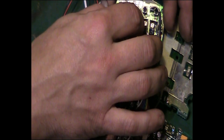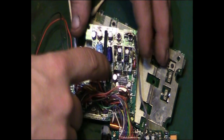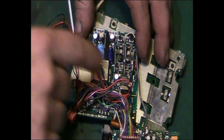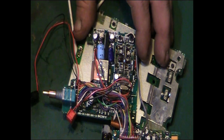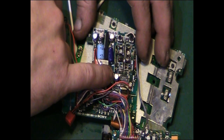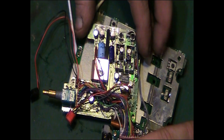Like I said, we haven't bothered actually putting a new one in because there was nothing wrong with that capacitor. But we have cleaned all the electrolyte damage that came from those three up, and those have been replaced with new capacitors. That one's been replaced with a new capacitor. That's what we did, the first one we did. So on this board, basically what we've got left now